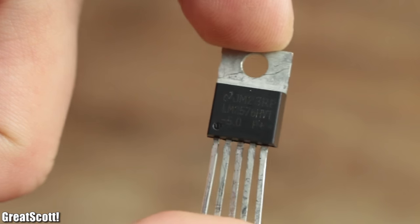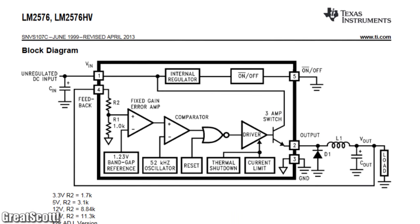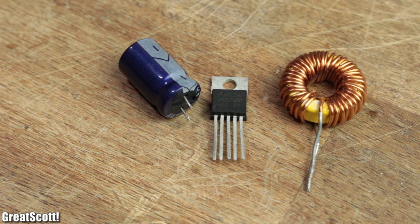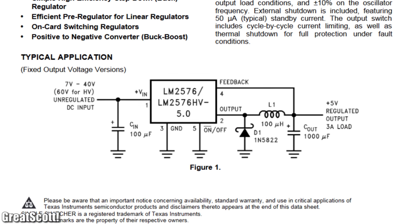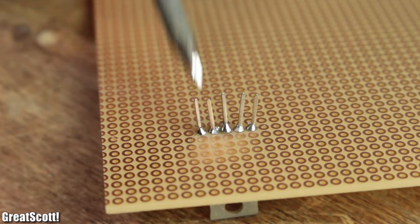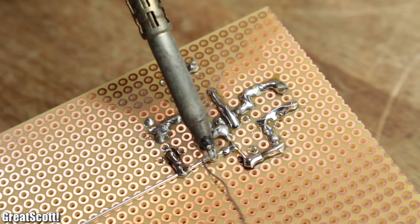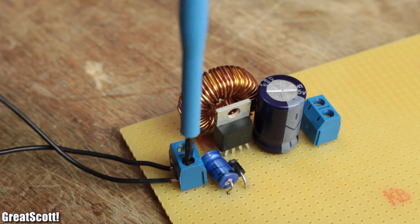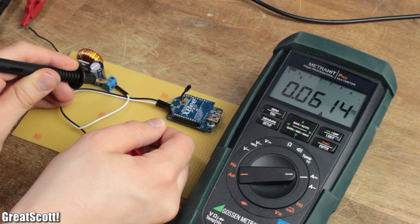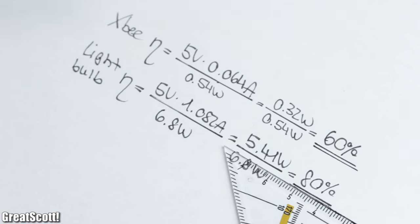I have the 5 volt version that has its feedback resistors integrated and only requires four additional parts to build a complete buck converter. The rule of thumb while recreating the schematic is to keep all the parts close together and create thick solder traces. After only 10 minutes of soldering, the circuit was complete, works flawlessly, and obviously reached a better efficiency than my demonstration circuit.